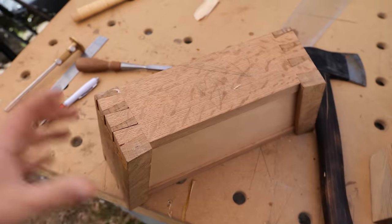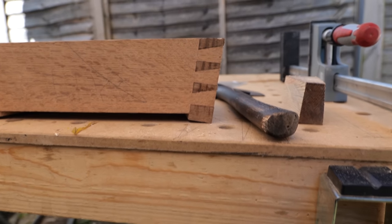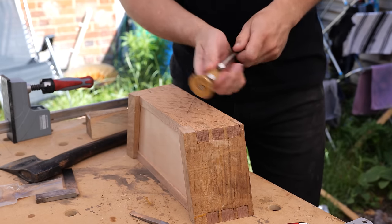But before drawing on the facets, I need to get the feet actually sitting flat on the workbench below, because you see they're still tilted with that compound angle. And to ensure everything stays level, I'm going to do this with a marking gauge.